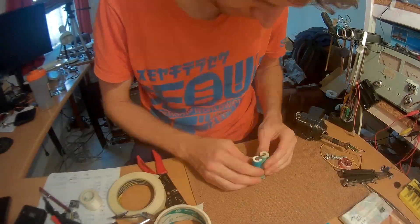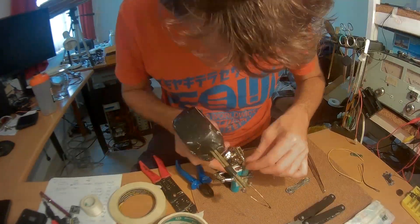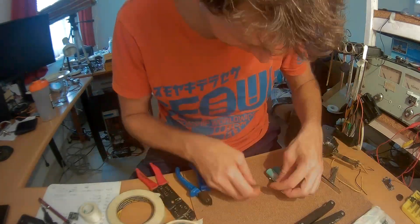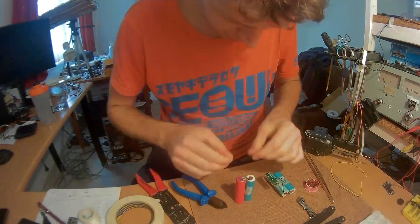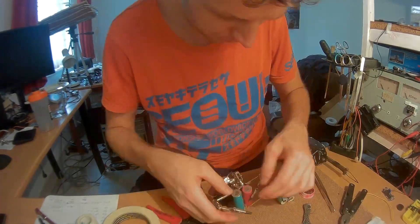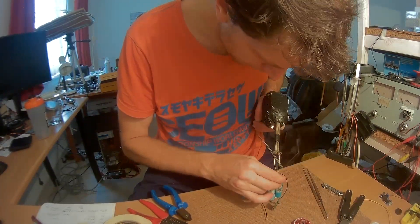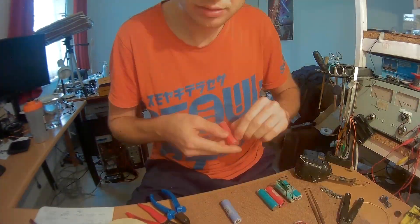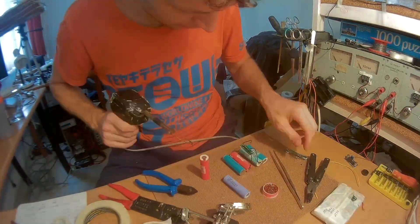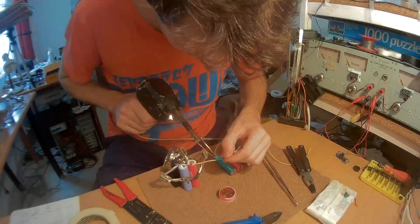Now we can create two battery packs. I'm using cells from old laptop batteries which I tested and sorted. I'm using protective circuits to ensure they charge and discharge equally. I'm using two cells in parallel for bigger capacity and three in series in one pack. The two packs are in series, so 12.6 plus 12.6 volts equals 25.2 volts, which is the right voltage for maximum power from the amplifier.